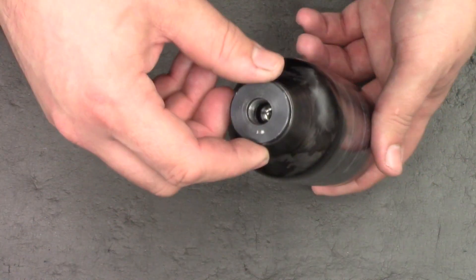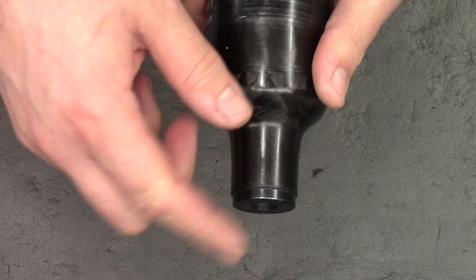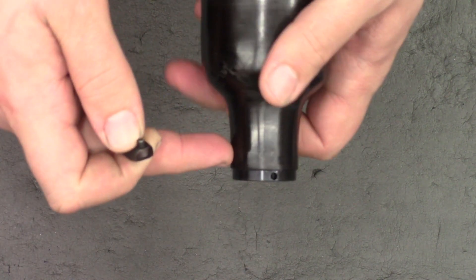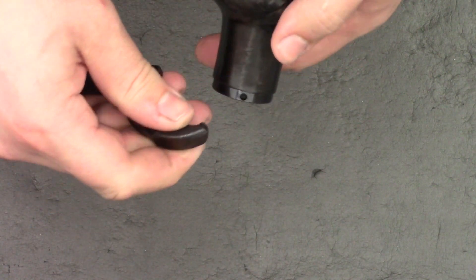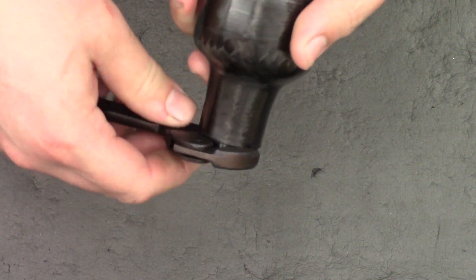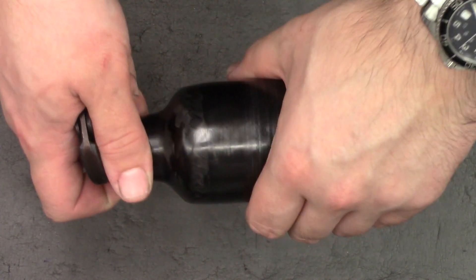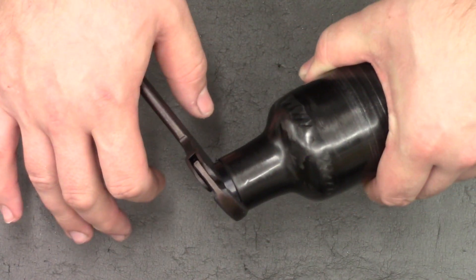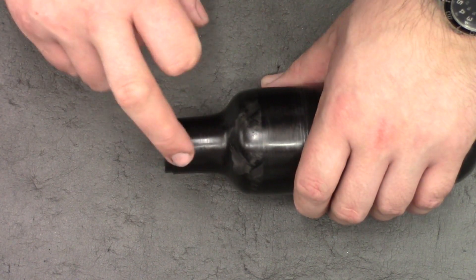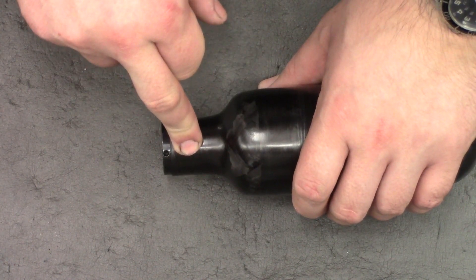Since I don't have one, I've already degassed the bottle using my little tool. Secondly, what we're going to need to do is take the valve out of the bottle. There's a number of ways you could do this. You can use a hook pin spanner like this — that just goes in there unscrewing it. This will need to be put in the vice with some nice rubber protection around it to grip it while you put some pressure on this pin spanner and undo the valve.